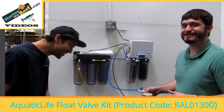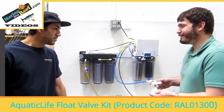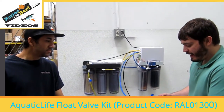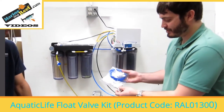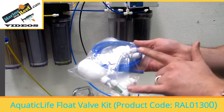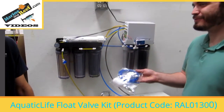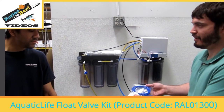What this float valve is going to do is — when you first buy an RO system, most people think, I'll just put the hose in my bucket and then I'll remember to turn it off. I had thought that and then I flooded my house, got some warped boards, and it makes you really realize how a $20 float valve kit is something worth getting. This float valve kit includes your float valve, which actually turns off the output water. The other two pieces in the kit are the auto shutoff valve and the check valve — those work together to actually turn off the wastewater. If you just add the float valve without those, the clean water stops coming out but the dirty water just keeps going down the drain, wasting water. We recommend you get the kit with all three pieces.